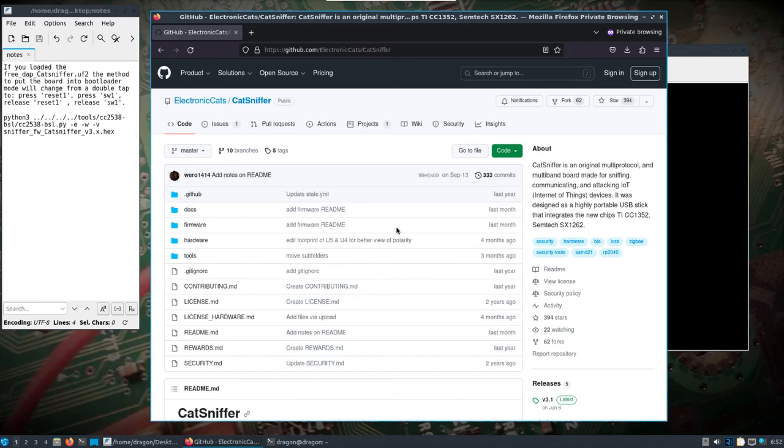Now, I will say I've had some challenges getting into bootloader mode for some reason. On my particular one, I had the LED 4 blinking when it should not be blinking. There should be a waterfall like effect down towards LED 4 of the other three lights, and LED 4 should be off. That was not the case for me.